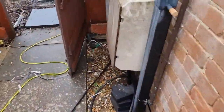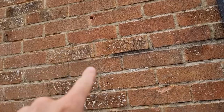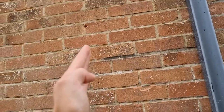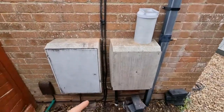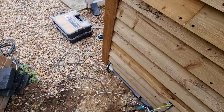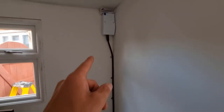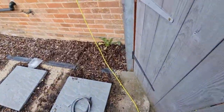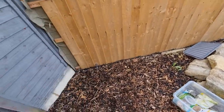That's all come out - there it is. Now we'll just put a whisker there, cleat down. There's our two armoureds - they get cleated up the middle there. So I'll just give you an overview: the cable comes through, drops down, that one goes that way, the other one's slightly buried underneath and goes in there - up there to the consumer unit. The other one is slightly buried across the slab, buried and in, then goes around to the other side where I showed you earlier.